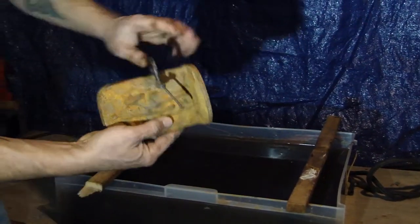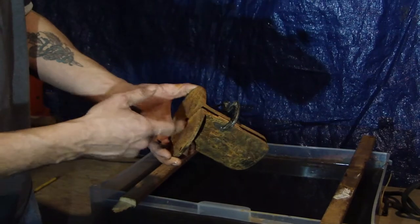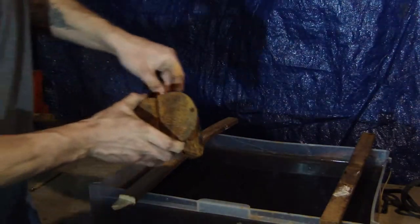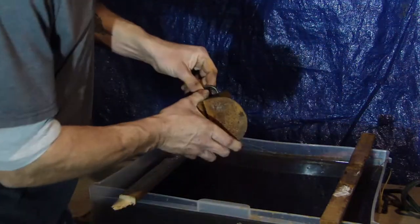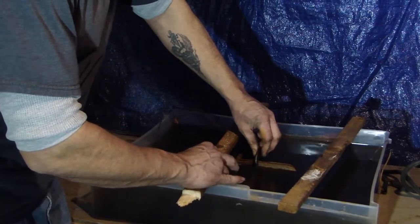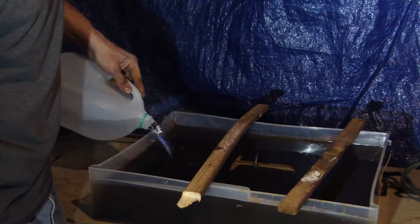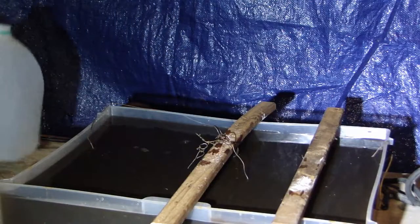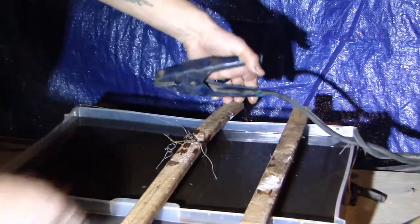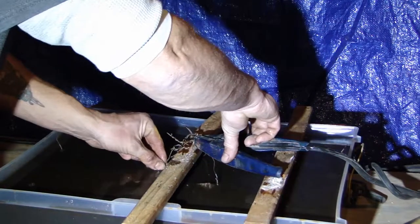I took my bookends, cleaned them, and stuck a little block of wood in between them just to keep them apart so the electrolysis will have a chance to do its cleaning in between. You want to suspend the pieces — you don't want them sitting on the bottom. So I stuck a clamp on there with a couple of sticks. Your ground clamp always goes to the wire that's going to your piece — always. If you do it the other way, you'll actually attract rust and stuff to what you're trying to clean, and you'll defeat the purpose.